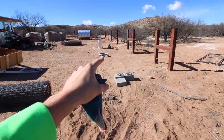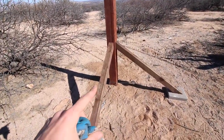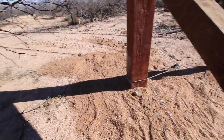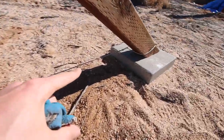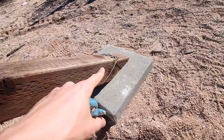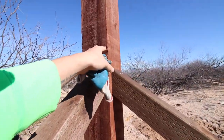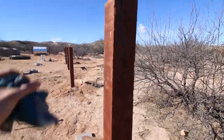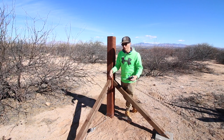We've got our two H braces for our gate and the spinning Jenny. Over here I've finished the first corner brace — I didn't show you guys this because I was unsure of exactly what I was doing. Basically I do a loop around the bottom called a Western Union splice, then the strainer, and a regular half hitch noose knot. This is pulling in one direction, which basically holds the post straight up — when we pull the fence, this post is not going to lean over. It's so solid I feel like I could drop kick it and it wouldn't go anywhere.